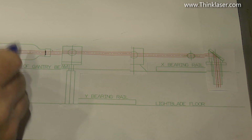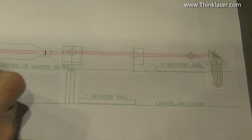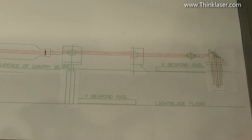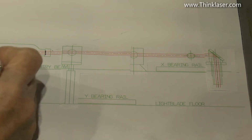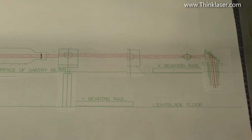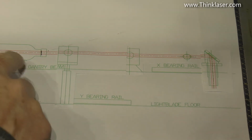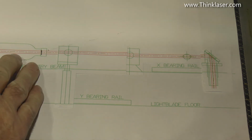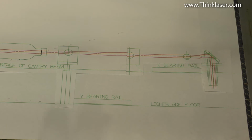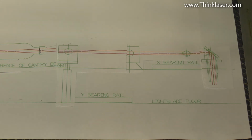Now even if this tube is very slightly eccentric, because the tube is so long, you can still probably assume that the external glass work will still give you a very good representation of the axis of the beam itself. So let's assume that we set the laser tube itself parallel to the floor. That's a good starting point, because everything on this machine is fixed to this ground point, this floor. Okay, so we've now got our laser beam travelling in a horizontal direction. But just in case we didn't do that, let's make it slightly wrong. How do we deal with that?